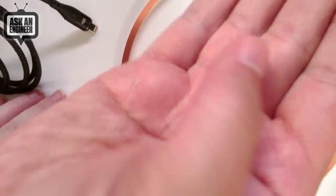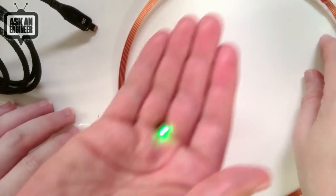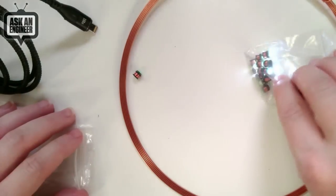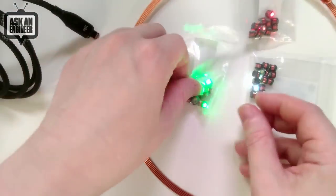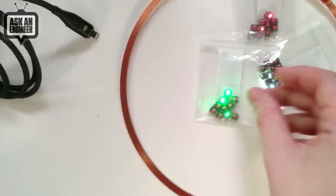So we did a couple measurements, using the big ring at 24 volts, of how far away each one will work. With white, blue, and the colors, they do act a little differently. Another thing we learned is not all the colors work at the same distances. So red, in particular, I think dims a little earlier than the green because the green is just ultra bright. So there you go.